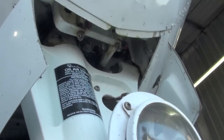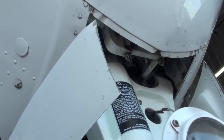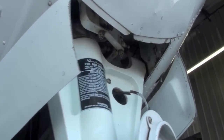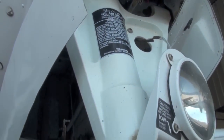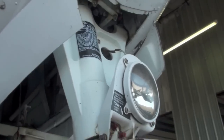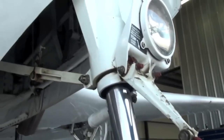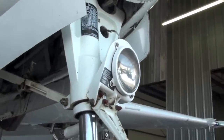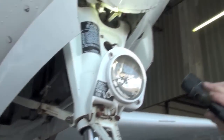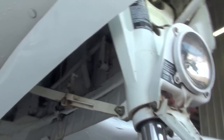Well, look right here. This is the left-hand steering stop, this bolt. All right, I'm going to turn it here. I see how it would come up against it. It hits that bolt. See? Right. I don't want to do this on the jack because we're wiggling. But it turns all the way around there. And what it does when it hits that bolt, it has a convex head, and it makes that cam turn so it has something to roll off of. Just like a lifter. Exactly. Same type setup. And we want to make sure that is rotated. But they have to take that out to replace the yoke bushing anyway. And they should replace it.